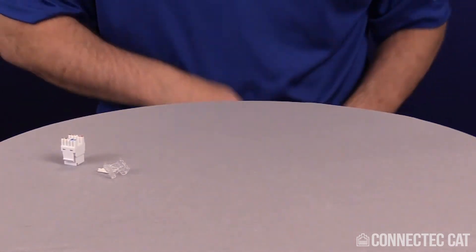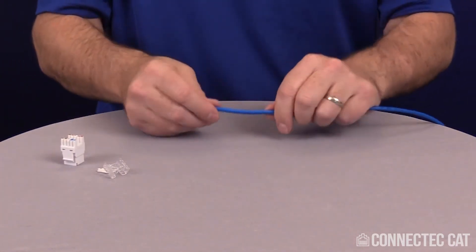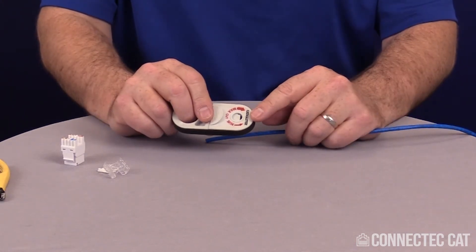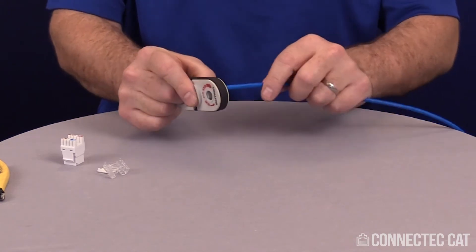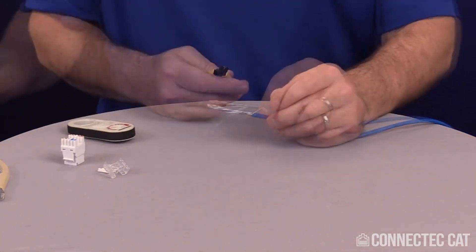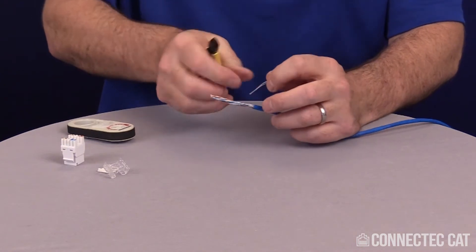The first process is going to be to prepare your cable — Category 5E UTP cable. Using a cigar cutter style stripper, I'm going to do about two inches, using the minimum spin so I don't cut too deep. I'm going to pull the ripcord off to one side and trim it — don't need that.